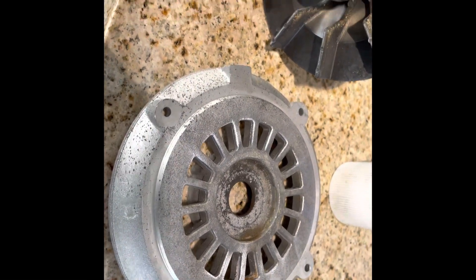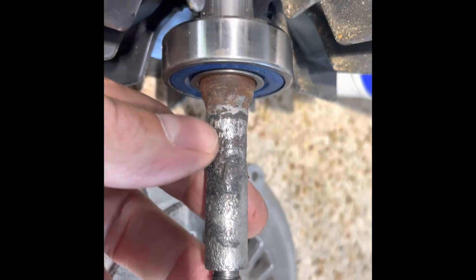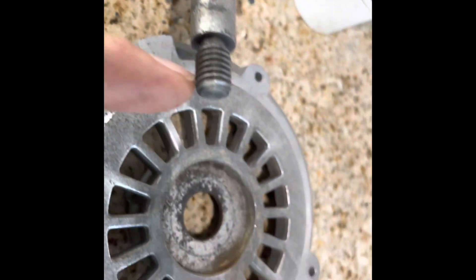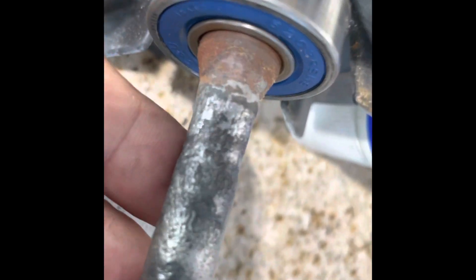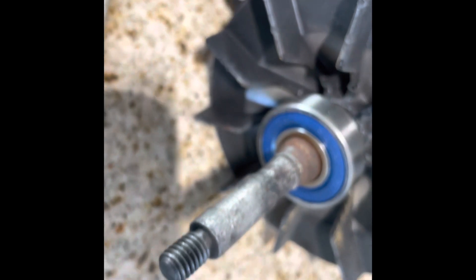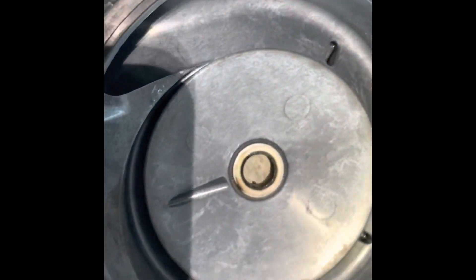Good news — I was able to wire wheel off the armature, but it's pitted really bad. That shouldn't affect anything though, because the seal will go around the outside of that part, not on the pitted section, so I don't think it's going to cause a leak. The bearings are good — front and back both feel real good — and even the little rubber cone washer that covers that looks good. I'm going to put the motor all back together, clean up the housing, and knock the old seal out with a socket — it just comes right out. I might even put it in the dishwasher.